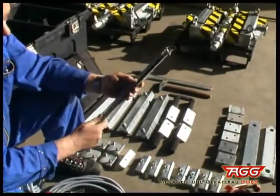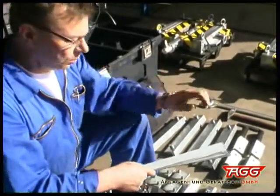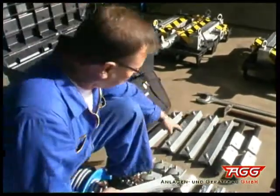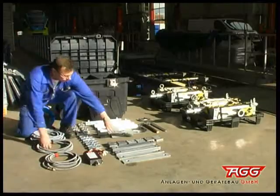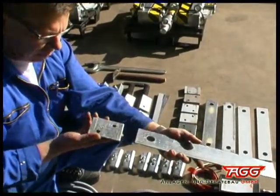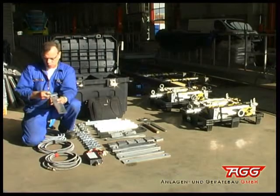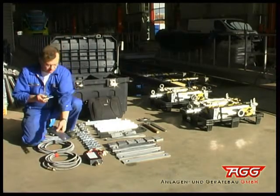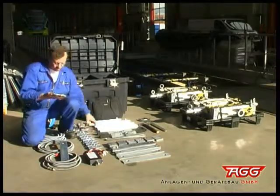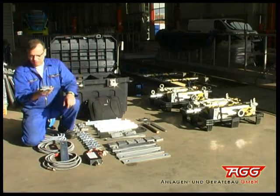By means of these distance measurement strips, you will make sure that the space between the flange and the rail is sufficient after the vehicle has been moved onto the scales. These shims for access blocks included in the delivery and available in different thicknesses, as well as those for the friction-reducing rails we have already introduced to you, make up for any differences in flange heights when you put them under the said blocks or rails.